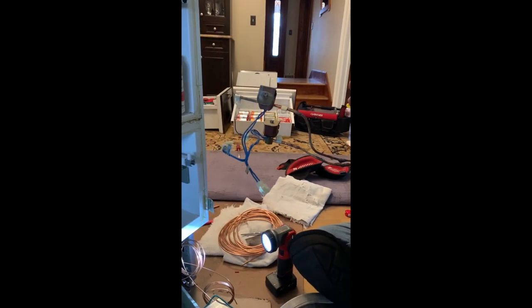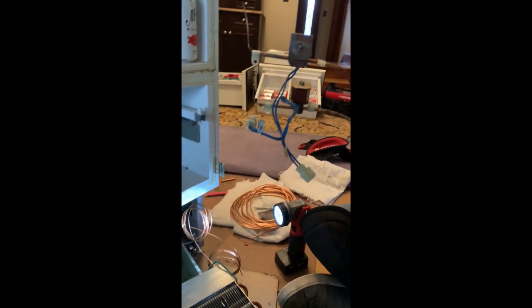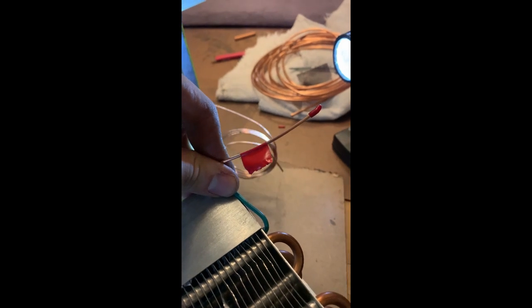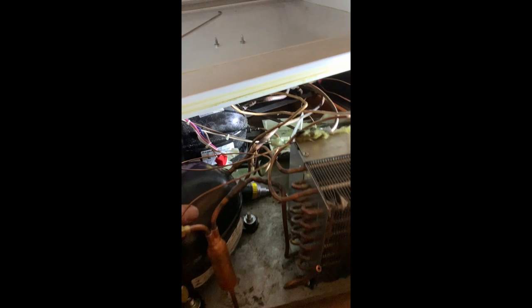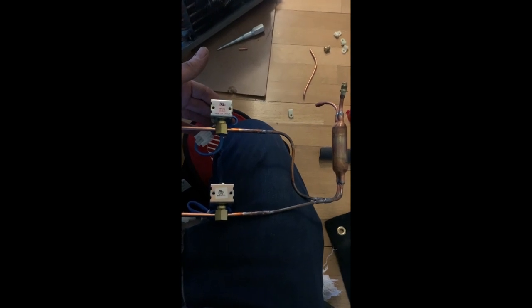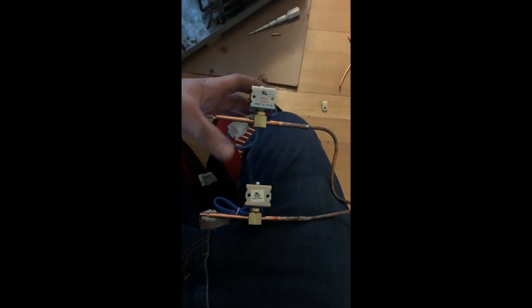Filter and valve assemblies are out. We're going to mimic that outside the unit before we solder it all back into place. Each valve has an electrical connection and they're labeled upper and lower. I use the trend of putting red tape on everything that denotes lower — so this is a lower heat exchanger. I tape the lower connections with red just to keep that trend going. You can easily check the wiring diagram, but this is easier. Got my valves all soldered together with the new filter — we'll get it back into place, capillaries go upper and lower.